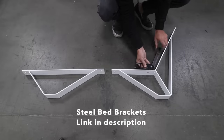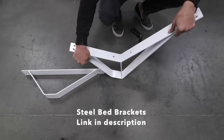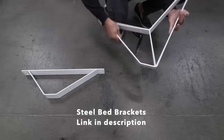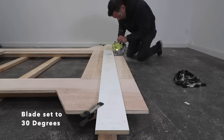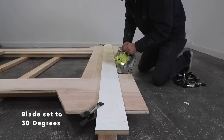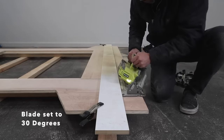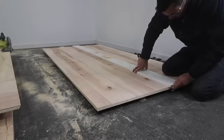That's because we're going to use these really heavy duty steel brackets from Semi-Exact. These are based on a design from a previous project that I did and they support an angled headboard set to 30 degrees. This is really nice as a backrest for reading or working on a laptop in bed. I clamped down the trim board, set my circular saw blade to 30 degrees, and cut through the two layers of plywood.